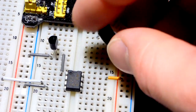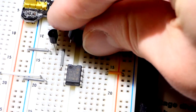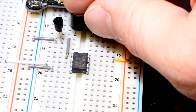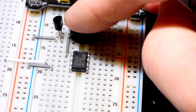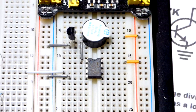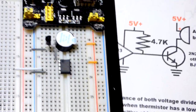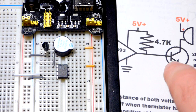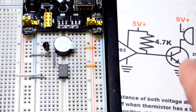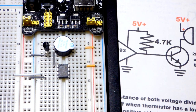We'll put the plus towards the positive rail jumper. This is kind of tricky because you can't really see the pins once you get it close enough to the board to insert it. There we go — make sure we got a connection on both sides. The LM393 does not output a positive signal on its own; for a positive signal you actually need a pull-up resistor.